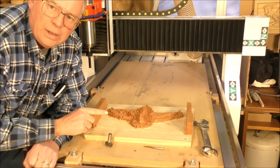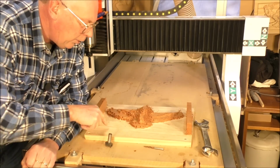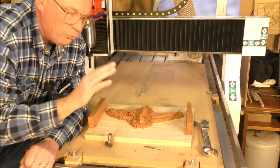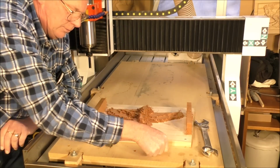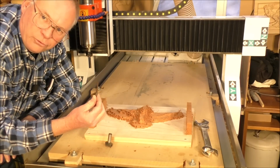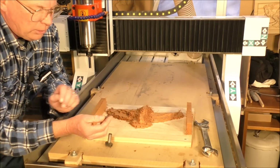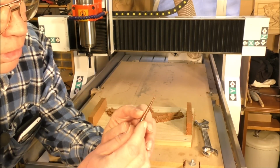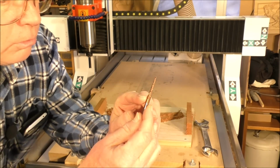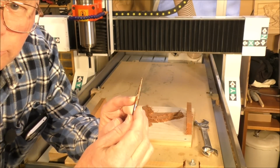Right, so the problem we have, or I have, is we've carried out the roughing cut which went without a hitch. Not a problem. But we're just going to put this tool in, and the cutting area, if I bring it closer, the cutting area up the shank here, or up the cutting face, is about 32 millimeters maximum.